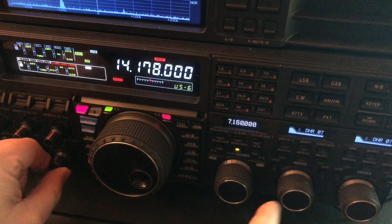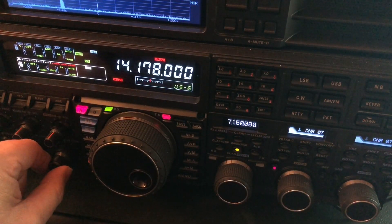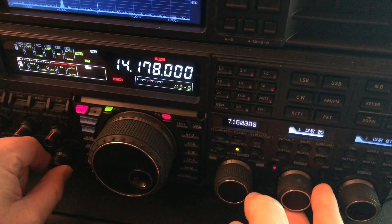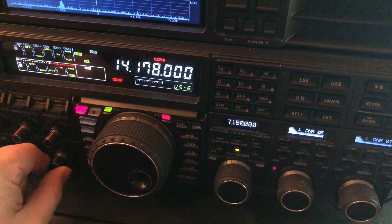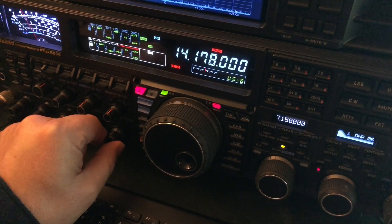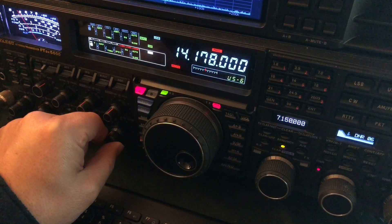The first level of defense I'm going to here is digital noise reduction. You know me if you've watched my previous videos — I usually leave that on anyway. I'm usually set between 5 and 7, sometimes 4. I've got a high noise floor right now. Not too terribly high, but there's some ground noise in there. He's bumping about three and a half S units.